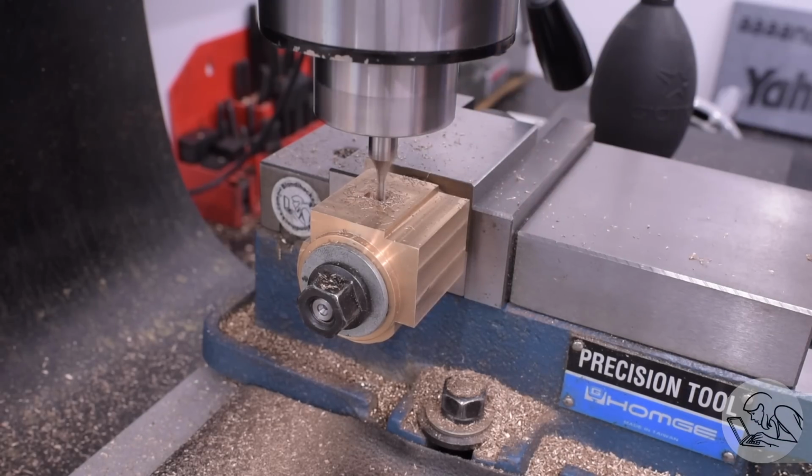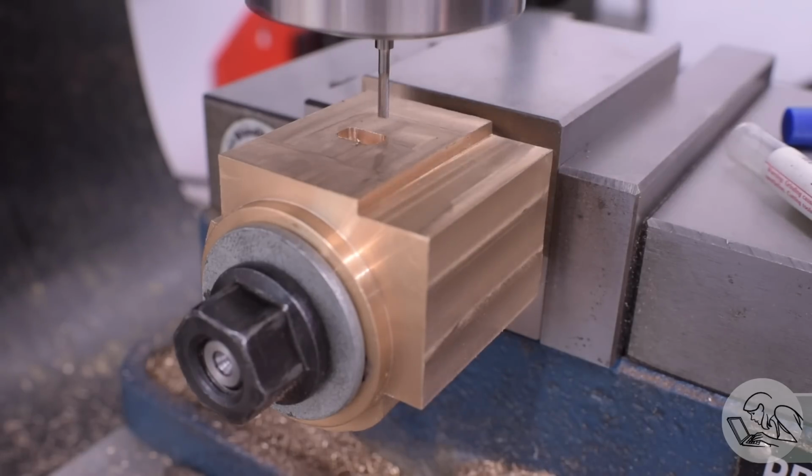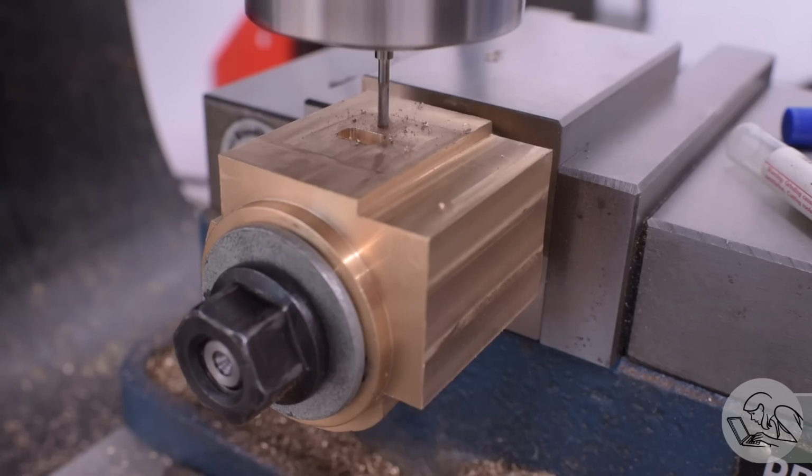The cylinder ends alternate being power strokes. So the end that is currently the power stroke uses the transfer port as an intake, and the opposite side is using it as an exhaust.